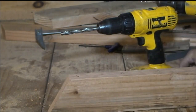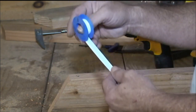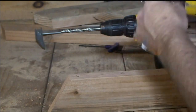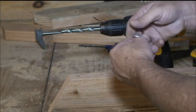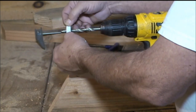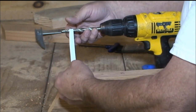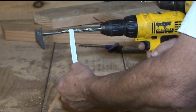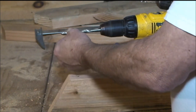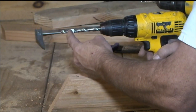If you don't have a countersink drill bit, which makes this job real easy, you can use some tape. I'm going to use some Teflon tape right here to mark my drill bit so that I'll know when to stop drilling — that way all our holes will be the same depth. I'm going to come up about an inch, which is how deep I want to drill. As long as you run this the same direction that the drill bit is spinning, just like Teflon tape on a plumbing job, it'll stay on there. Now I have a little guide that's going to tell me when to stop.